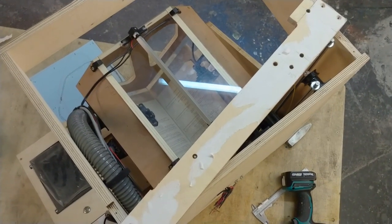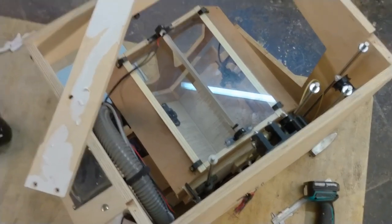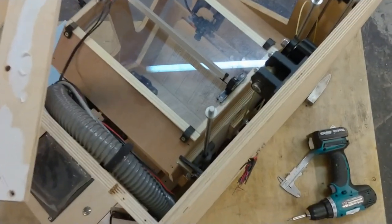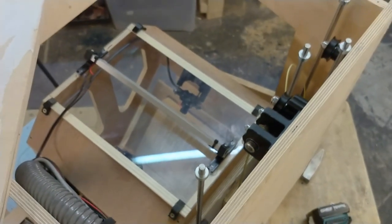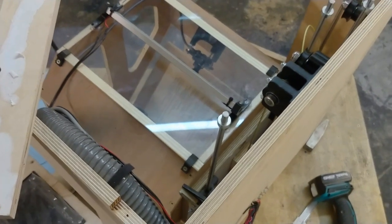Here is the part — it now has its necessary cutout and we can get to the root of the problem. The reason why the suction box even fit through the opening in the top without this cutout is that this part down here is actually 15mm thick instead of 12. In the CAD drawings it's 12, and in the bill of materials it's 15, because I pasted the wrong product number in the field. So I ordered the wrong piece of wood, made it with the wrong piece, and it ended up too thick. Now I need to take off the suction box, take out the connector plate, remove all the hardware from it, run it through the thickness planer, and then put it all back together.